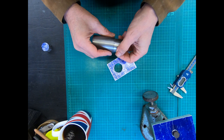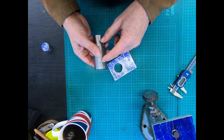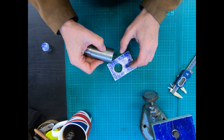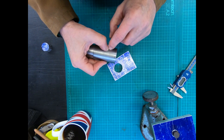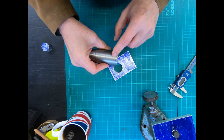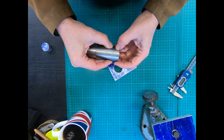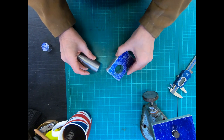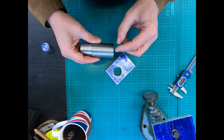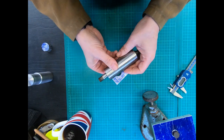I'll turn it down to 34.5mm so then I can bring it out that extra half mil and make sure I keep it round — it's got to be straight for it to work. I'll finally bring it out to 35mm to match the spindle. I must admit it's driving me mad. When I was an apprentice, the first eight months of our apprenticeship we spent filing. Although I have some knowledge of this, it was a long time ago and I seem to have forgotten everything.